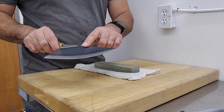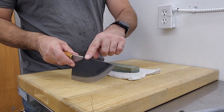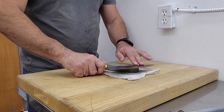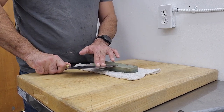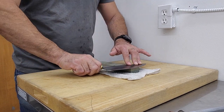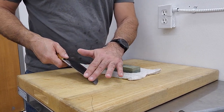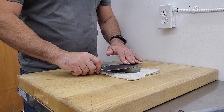I need to get rid of this edge. On this side, if I'm holding the knife and I'm looking down on the right-hand side of the knife, it's rolled. But on the left-hand side of the knife, there's a wider edge there and it's really uncomfortable. So I'm going to hold this knife relatively flat and try to sand that edge down. Same thing will happen if you've ever sharpened a garden tool like an axe or a shovel, a hoe — anything like that.